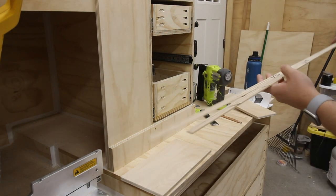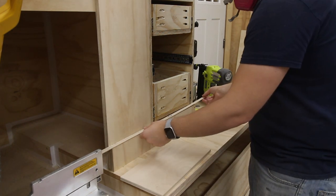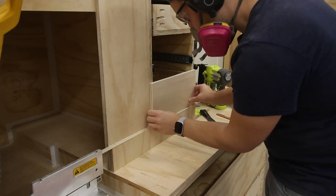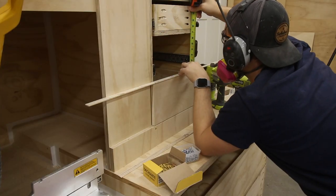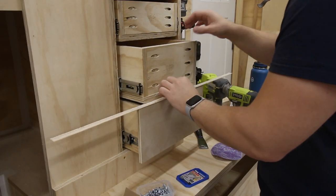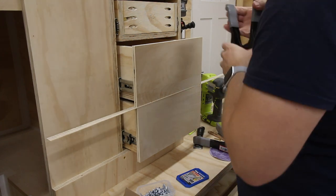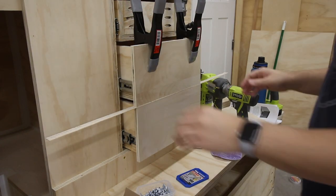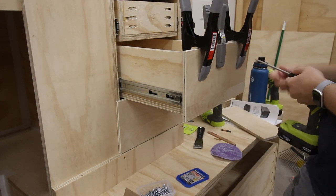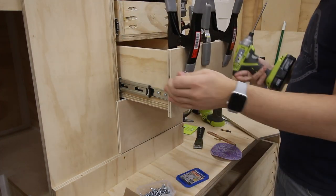The drawer fronts are sized to allow a 1/16th of an inch space between each drawer front, so Jay brilliantly shared a suggestion of using two spacers: one that's 1/8th of an inch thick and one that's 1/16th of an inch thick. Using the 1/8th inch spacer, I measured from the top of the spacer to the bottom of the drawer above, then swapping off the 1/8th inch spacer for the 1/16th inch spacer, I placed the drawer front down in front of the drawer and clamped it to the drawer. For the bottom drawer, this obviously requires removing the drawer above in order to clamp, but for the drawers above the bottom one, you can simply pull the drawer below out to rest the spacer on while doing the same steps.